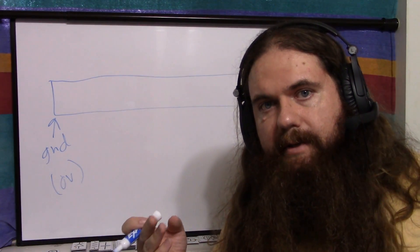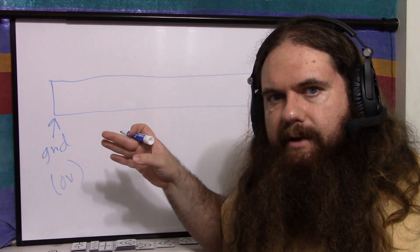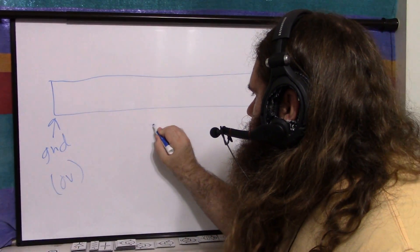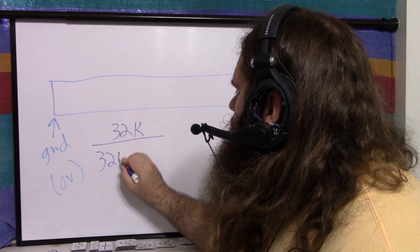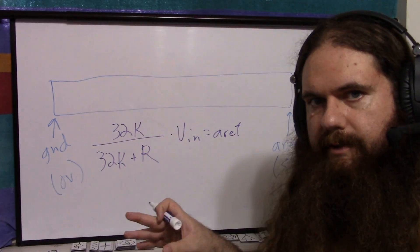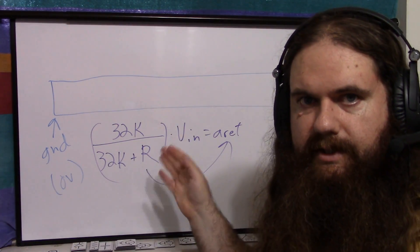You always have to make sure that if you have EXTERNAL connected, you also have analogReference set to EXTERNAL before you analogRead — you have to be very, very careful. Alternatively, put a resistor. The spec recommends 5k resistance; I used 5.6k. The spec says there is a 32k resistor in there, and when you connect your resistor such as 5k, it forms a voltage divider. The formula is: (32k / (32k + your resistance)) × VIN = AREF. So pick your resistor near 5k, calculate this, and you get the voltage the AREF pin will actually see.